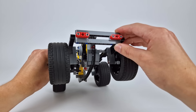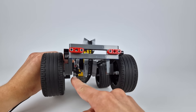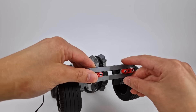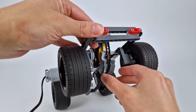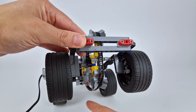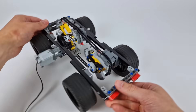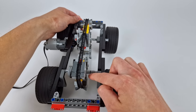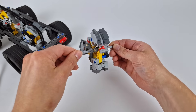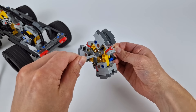And this brings me to the next problem: unless I want to raise the body even higher off the ground, this is in the way of me connecting a rear axle between the wheels here to drive them. Bear in mind of course that right now the output wheel is at its smallest size, but when the gear ratio increases, it will expand all the way to this size, meaning we'd need the rear axle to be all the way down here. To get round this, I thought it would be simple to drive each of the rear wheels independently from each side of the output wheel. Sounds easy enough?